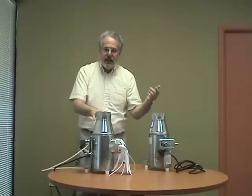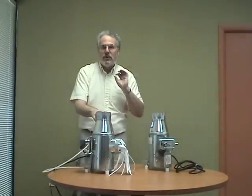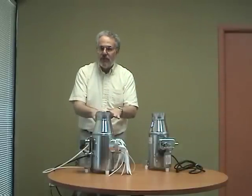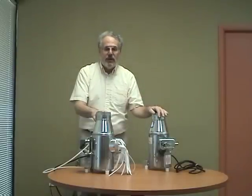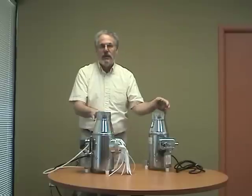The Army Corps of Engineers and the new UL standard for dryer boosters, if it comes to pass, specifies a minimum of 1,200 feet per minute of air velocity and a maximum of 2,200. We never get to 2,200 so we're safe that way. We have tested it at 100 effective feet, which can handle almost any house. That includes bends and straight pipe.